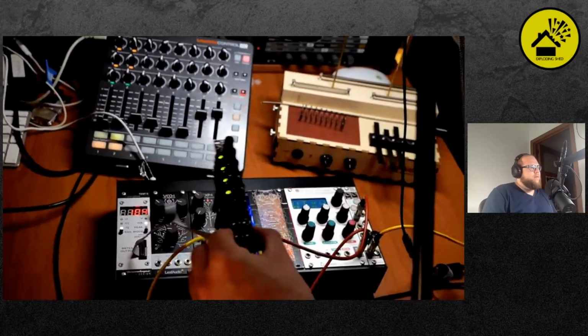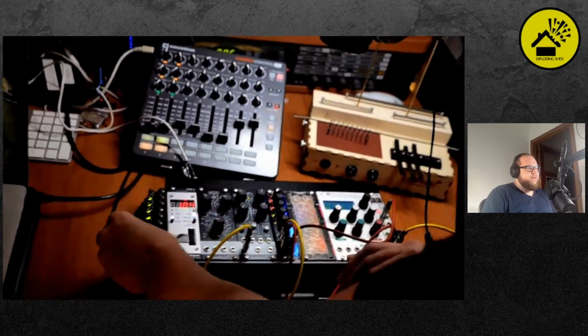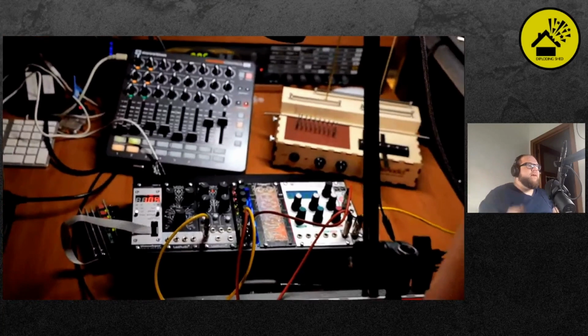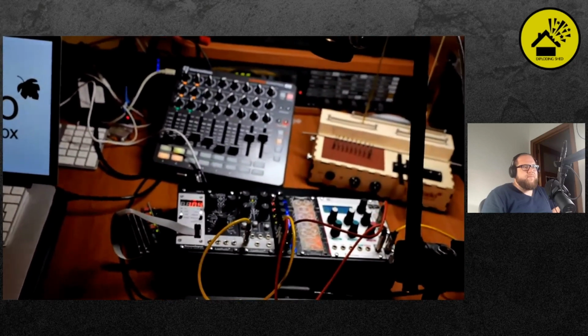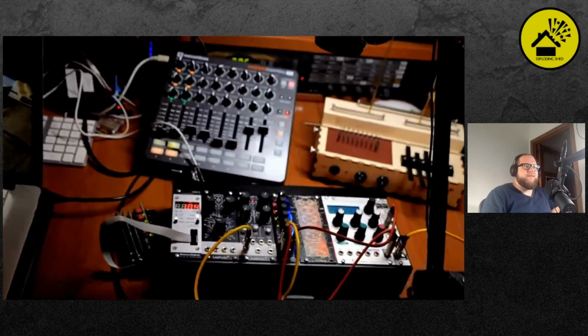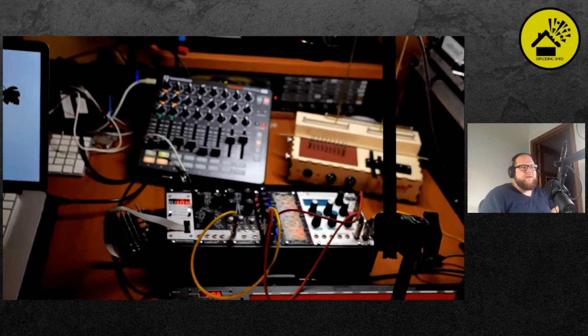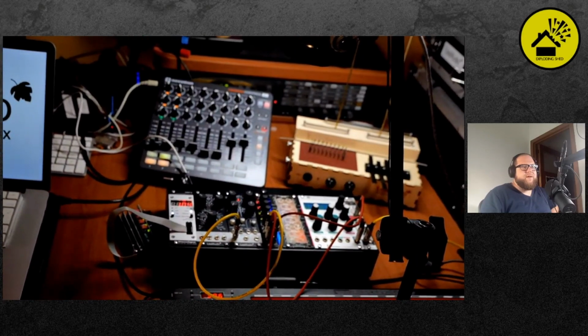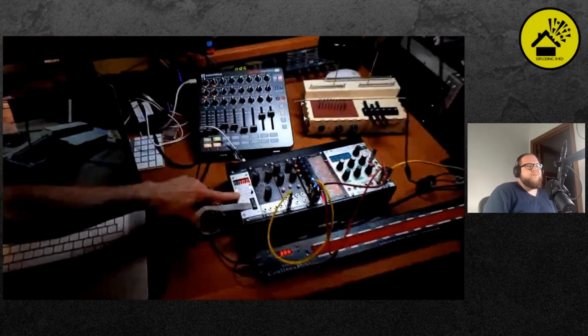By the way, a tip perhaps. Some people who already have quite a full case plug in the MS-22 and they say it gets noisy or strange stuff starts to happen. Keep in mind that MS-22 is quite power hungry, about 100 milliamps on both rails. In most of these cases, the strange stuff that people observe is a consequence of hitting the margin on their power supply. So if that does happen, try unplugging a few other modules, and if that goes away, then it's your power supply that's not juicy enough. To be clear, it hasn't happened that much, but enough to see a pattern.